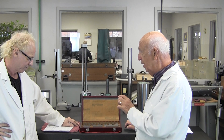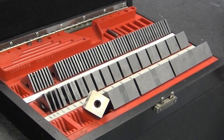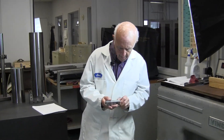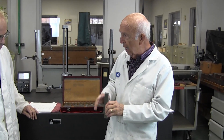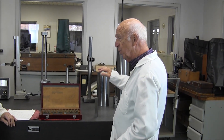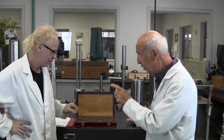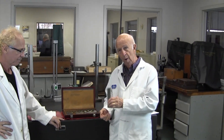Because there are different kinds of gauge blocks, they have different functions in many people's eyes. There's a square set. One of the nice features is it has a hole in the middle. We have one over here - this one happens to be six inches. When you get in height, it's a lot more stable. So when you're putting it on a surface plate and you get up 10, 12, 14 inches, the square set is better from a stability standpoint - it's not going to fall over. The hole is so that if you want to bolt them together, you can put a rod through them and bolt them together.